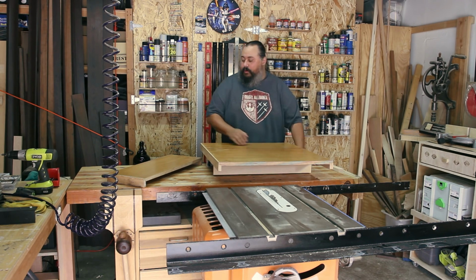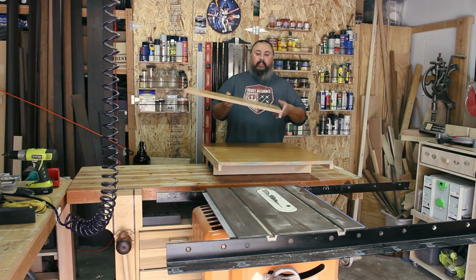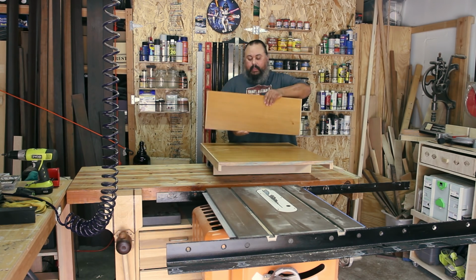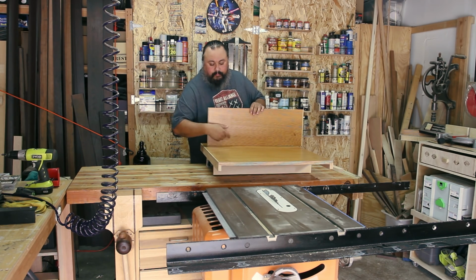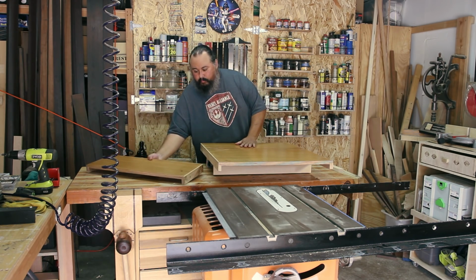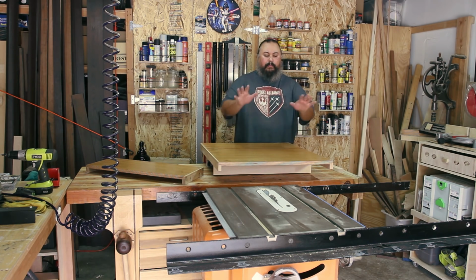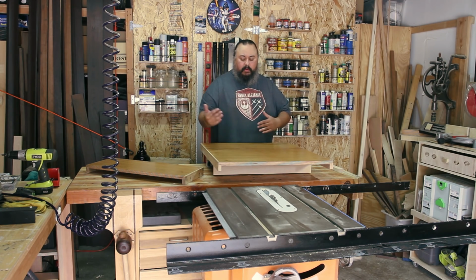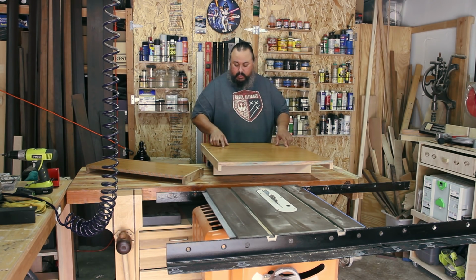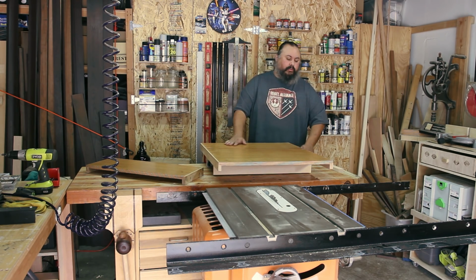And when I saw what he was throwing away at that cabinet shop, which is this 7/8 inch plywood covered in Doug fir, it looks really cool. I'll give you some close-ups in a little while. But it's Doug fir, so I brought it home. I put a whole bunch of coats of polyurethane on it, and then I prepped it. The panels he was throwing away weren't big enough, because he was just throwing away parts, so I put two pieces together using dominoes for strength.